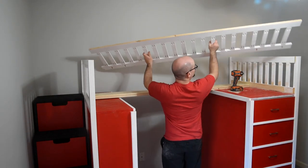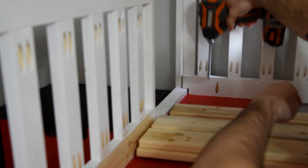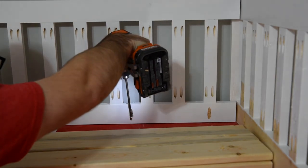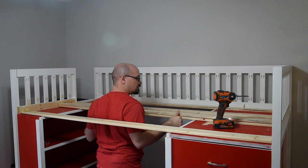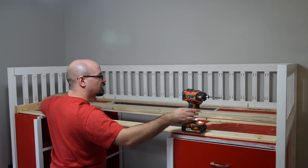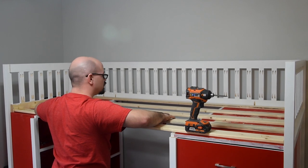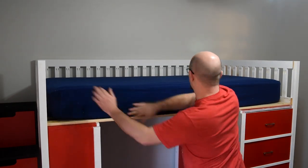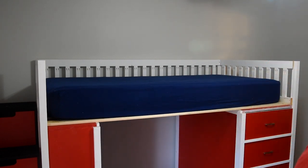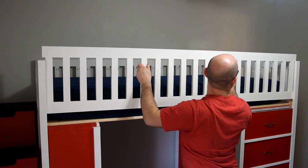Getting the piece in the room took a lot longer than I anticipated. When I cleared out the room, I remembered that it had been decorated around touch-up spots and holes from the previous owner, so installation went on hold while I repainted the room. You'll notice the mattress supports for the top bunk are running longwise instead of across the span — that's because the span between the cabinets is about the same as the width, so I don't need stronger material, and running them the normal way would have required adding another rail, which would have raised the mattress even higher.